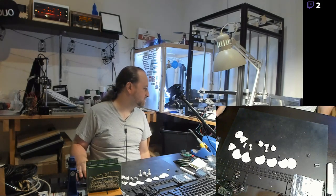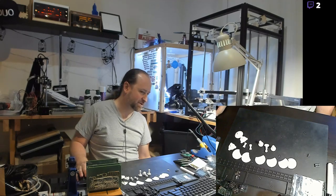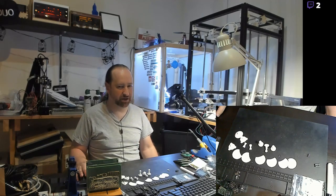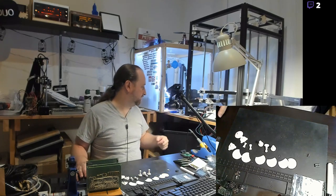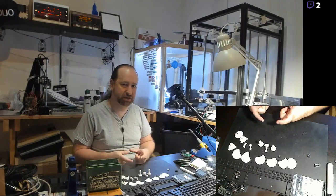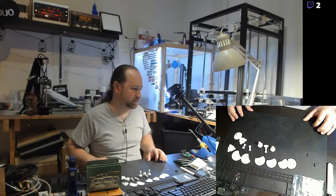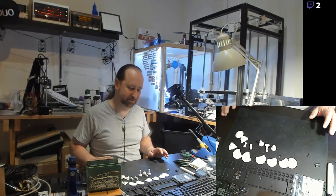That's one of the things I'm trying to figure out, because the Duet Wi-Fi with the RepRap firmware is something that I haven't had a lot of chance to play with, so I'm still digging into the documentation on that. I just found out yesterday that there is a special G-code M command to specify that the second extruder is actually a second Z driver. Artemis uses it. Yeah, okay, so Artemis would be nice.